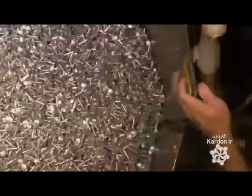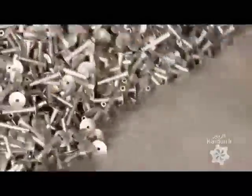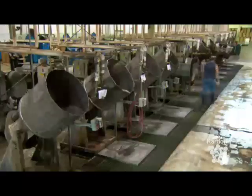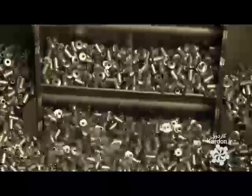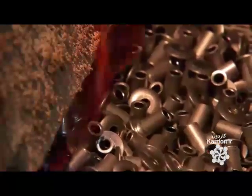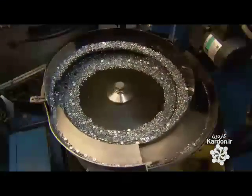Next, the rivet bodies go for a tumble in a cleaning solution to remove oily residue left by the forming. The rivet stems also undergo this thorough washing. The rivet bodies then travel through a furnace. The intense heat, followed by a gradual cooling, anneals the metal to free it from internal stresses. After zinc plating, the rivet bodies head towards the next station.